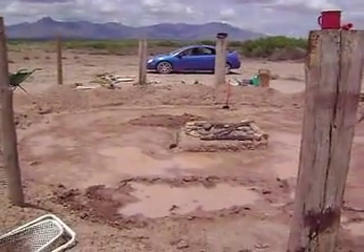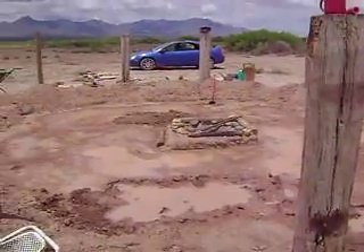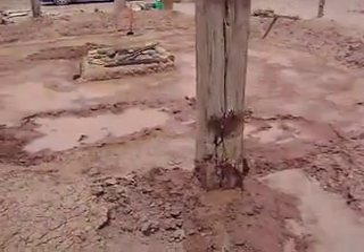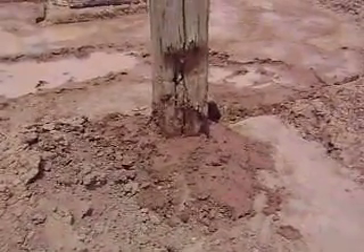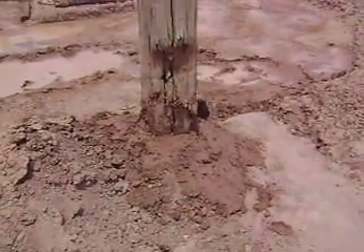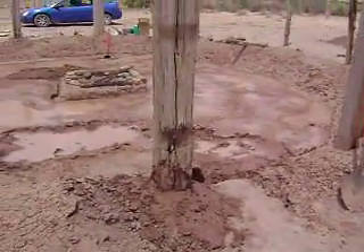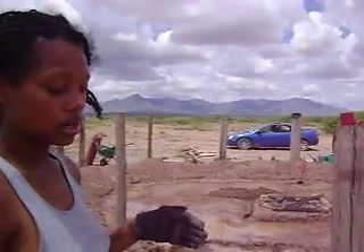What we've done is, since we need to take the dirt out anyway, we shovel the dirt and then put it on the posts — it's going to pack it a lot more. In previous videos, you saw us pouring water on dry dirt in order to pack it, and we found that worked, but it's not as effective as putting wet mud on. It's kind of like cob, with the exception of the sand and the straw.